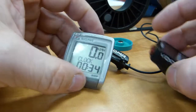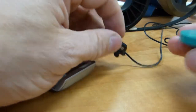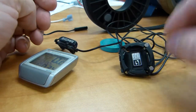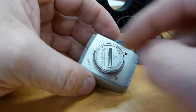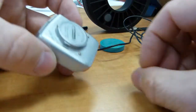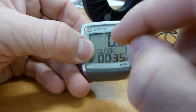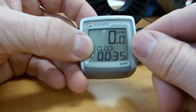What the head unit does with this wheel size is — it's basically an addition machine, a very simple calculator. Every time a voltage signal, a voltage peak or pulsating voltage signal, comes in, it adds. This signal needs to be amplified because it's so weak — it's in the millivolt range. That's why the head unit needs a battery, and if this is wireless, the sensor needs a battery to transmit this pulsating voltage signal to the head unit.